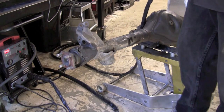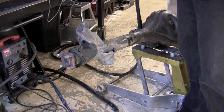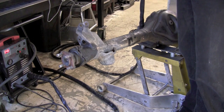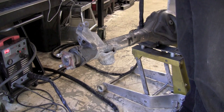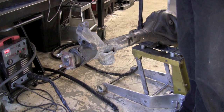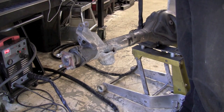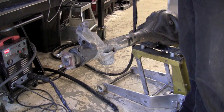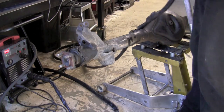Got the machine dialed in at about 48 amps. I'm running about 100 pounds of pressure on the gauge. Once I push the button and stuff starts to flow, we're looking to drop to about 90-95 pounds. What I'm going to do is just rough cut out these brackets to make sure that the piece I want to keep — which is the actual housing — stays unaffected by the heat and that I don't cut down into it.